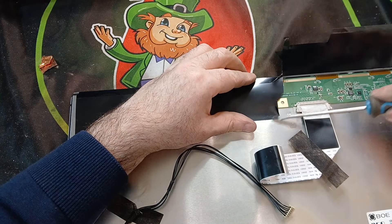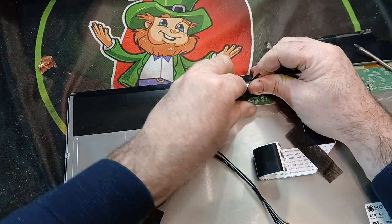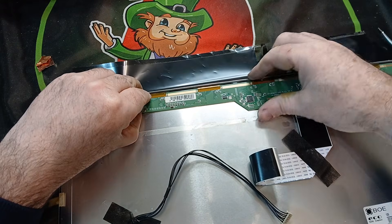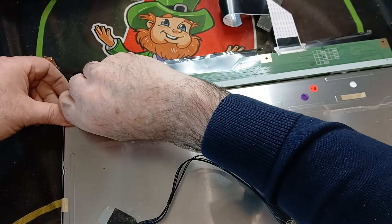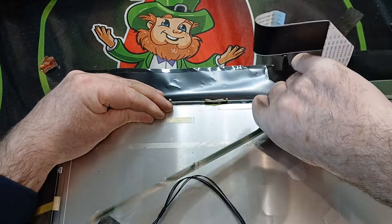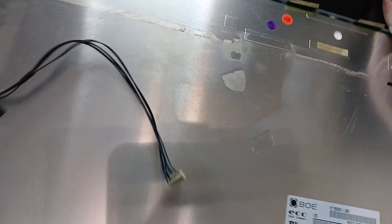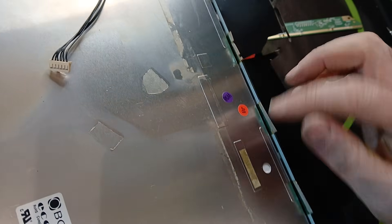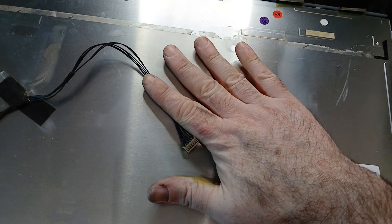I don't want to put this through my hand, that's why I'm carefully removing this tape. Check to see if there are any little screws holding it in place — doesn't seem to be, it just pops off. I've removed that strip. I also check the ends to see if they have actual gold fingers on them. If they do, I'll cut them off, but this one doesn't.